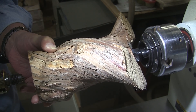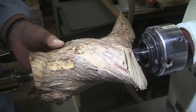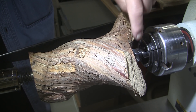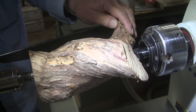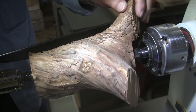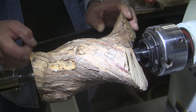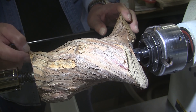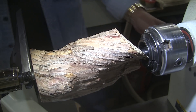I've got the top end lined up. Now I'm just driving in the live center. I've put my four-prong drive center in the chuck jaws — there's no point in taking the chuck off, and I'm all for that. So I'm just applying some pressure here. First thing I want to do is make a tenon on the bottom, make a base for it to set on. So I'm going to bring up my tool rest.